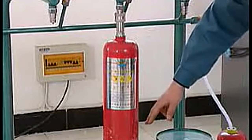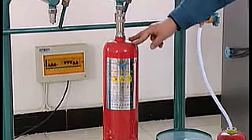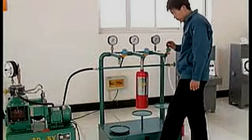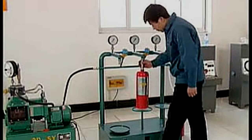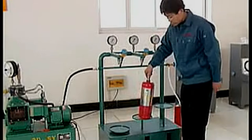Close drain tab and start fire extinguisher hydraulic test. Test pump automatically stops when pressure reaches the setting pressure. Check if the fire extinguisher canister has a leak or not. Accomplish fire extinguisher hydraulic test. Take out canister after accomplishing test pressure. Discharge water.